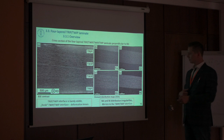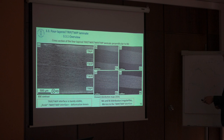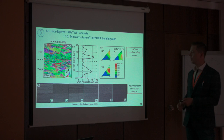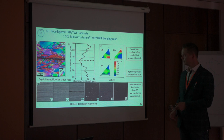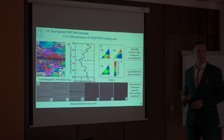Finally, we do the second rolling. This is our laminate which has four layers — you can see it with the EDS map. The layer formed during the first ARB step is perfectly bonded; you're not even able to see the border. Only when you do the chemical analysis are there some small oxides along the interface, but it's perfectly fully bonded. The fresh layer in the middle between TWIP and TWIP steel could look like there is no bonding because the EBSD shows black non-indexed points, but actually it's severely deformed, and as you can see on the chemical maps it's fully bonded as well.